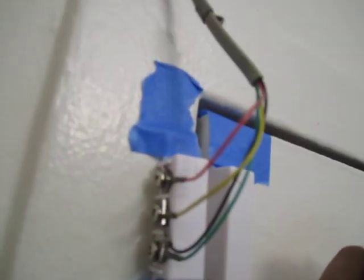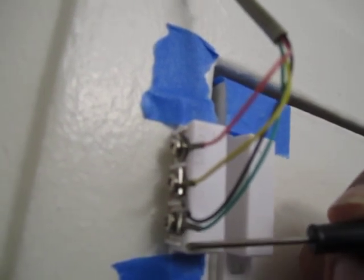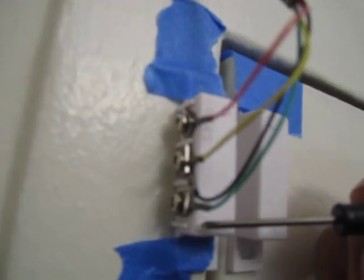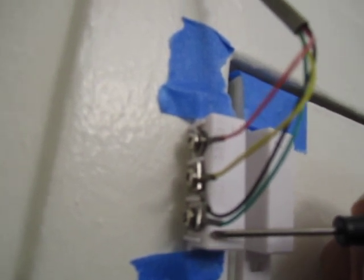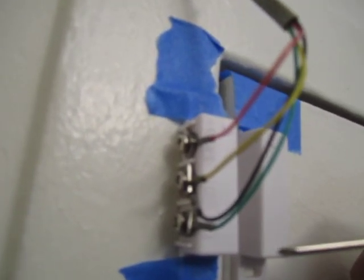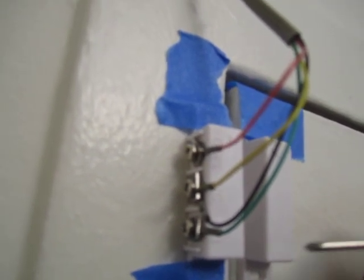So all we really have are 2 wires here, and it's wired through the normally open terminal because, again, in the normal state, the circuit is open. Now, when the door opens, that will actually close the circuit, and thus it will take the telephone line off hook. Now, why on earth would we take a telephone line off hook when we open the door? But there is the beauty of this solution.